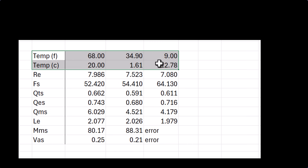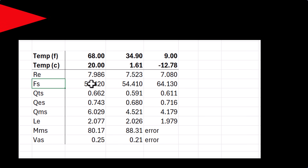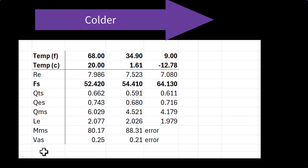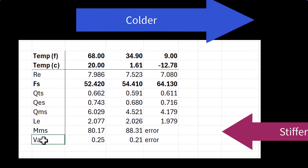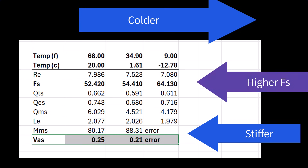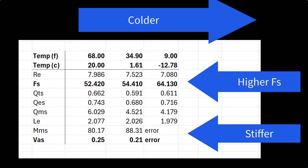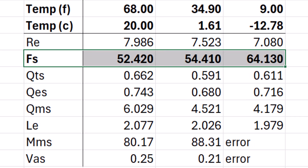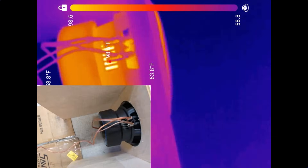What does all that mean for you and your subwoofer? Absolutely yes, your subwoofer will be stiffer in cold weather — but how much does that actually matter? First, it depends on how cold it gets. Going from 68 degrees down to 34 or 35 degrees made very little difference, so there's no need to worry about it except in cases of extreme cold weather. Second, the suspension will get looser as you play it — it will generate heat and that warmth will help soften up the suspension. That higher resonant frequency when cold is going to impact your sound quality. You'll have a harder time hitting low notes until things start to heat up and soften up a bit.